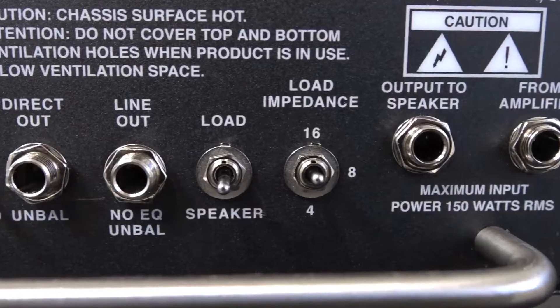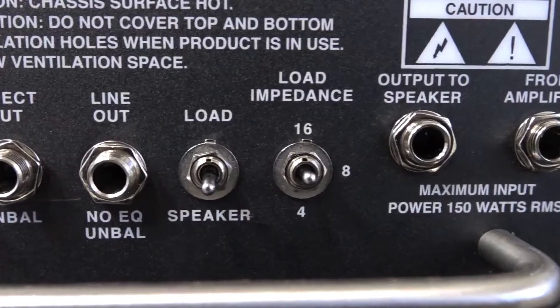We gave the Mini Rock Rec three of the most popular impedance loads: 4, 8, and 16 ohms. That allows you to have the correct matching with your amplifier so that the tubes are actually seeing the proper load reflected onto the tube through the output transformer, due to the tight tolerances of our resistive elements. That means you're not going to overheat your screen resistors, the tubes are in the proper operating parameter — all of that is very critical.